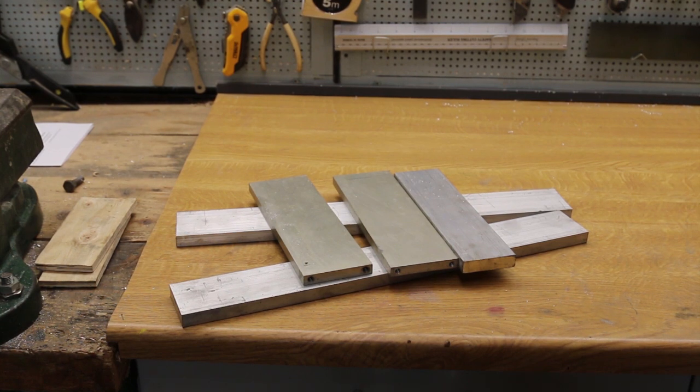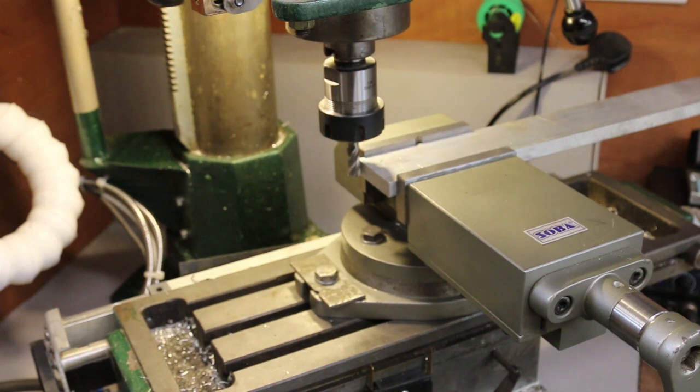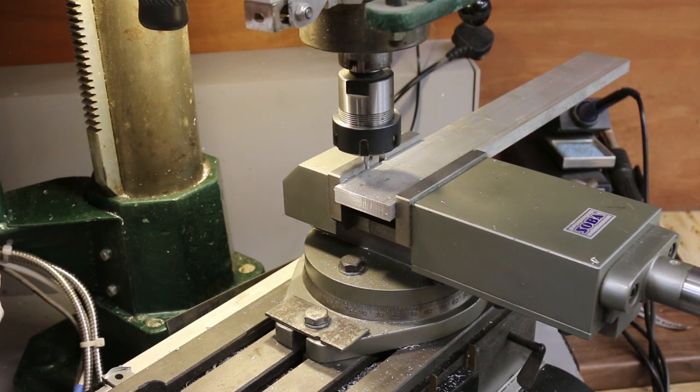The y-axis frame I'm going to fabricate using 12.5 and 9.5mm plate. Fabricating the frame will require more precise hole drilling to take the bolts, but first I'll face off the end of the strip, which will also establish the zero. With the end mill square I'm now going to drill and counterbore all the holes.